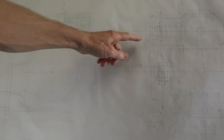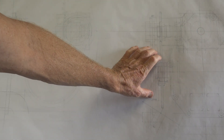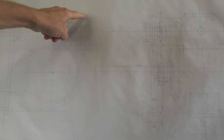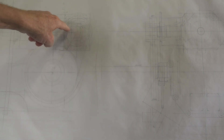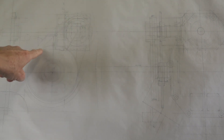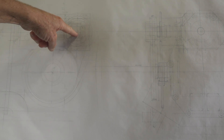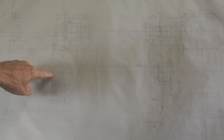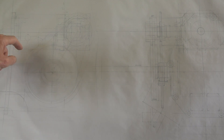Now to finish up what we need to do here: we need to get the drive down to the input, to the clutch, to the gearbox, which is down there and down here, using the primary drive chain from the Harley-Davidson onto the Harley-Davidson clutch. This is an 18-tooth sprocket; that's a 36-tooth sprocket. Going on the internet to our sprocket and chain center distance calculator, with 50 links in the chain, the distance from there to there wants to be 141mm. I've actually lowered the gearbox a couple of mil to get that to 140-odd, and I can shim it under here to get it exactly right.